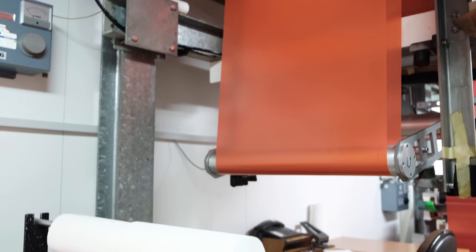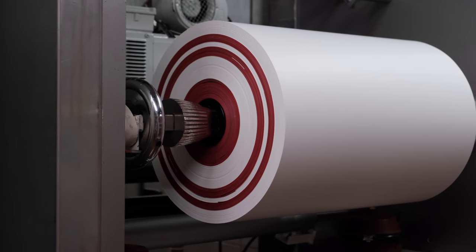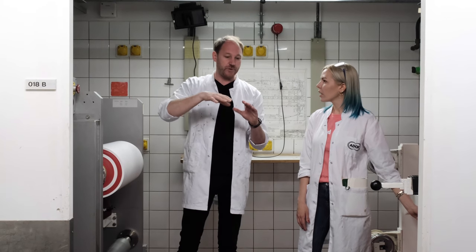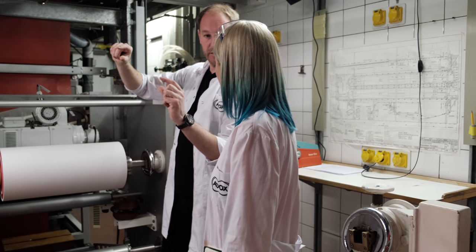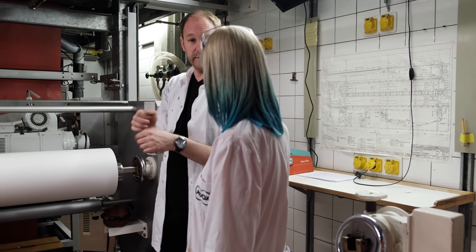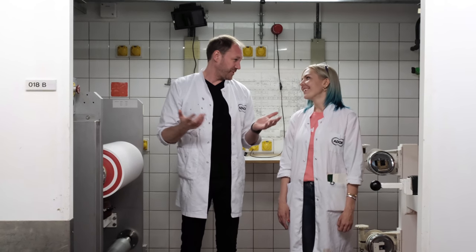We're going to glue it to the red tape. And then the red tape is pulling it up to the cascade. Then the real paper is being coated. We have a very sophisticated gluing thing. For example, we don't glue it like this. We glue it with a certain angle that helps us when it passes through a narrow gap, so that it's not tearing. Because if this ever tears, for weeks we are repairing the machine again.